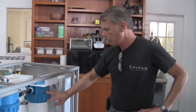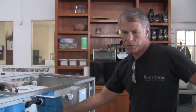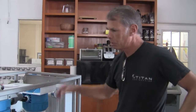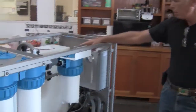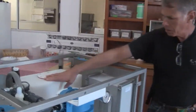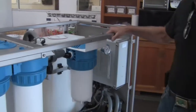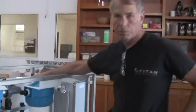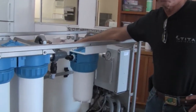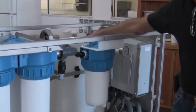This is a carbon filter, or activated charcoal filter, which is used as post-treatment. It takes any odor or taste out of the product water. Behind the carbon filter, there's a fresh water flush tank. During the first few minutes of operation, this tank gets filled with clean potable water and is available to do a fresh water flush at the end of every run cycle, which is what we recommend.